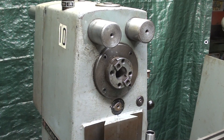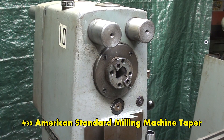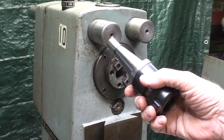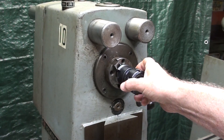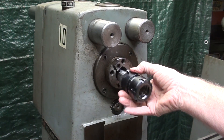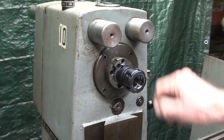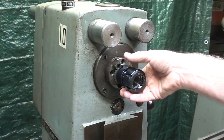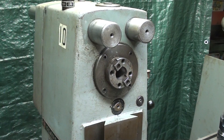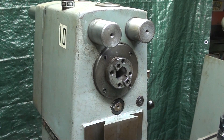Some of this is a repeat that has been mentioned in previous videos, but this is a number 30 American Standard Milling Machine Taper. It's a steep taper. It is not a self-holding taper as are Morse tapers and many other tapers. So in other words, if you don't have a drawbar to hold this in, it isn't going to stay in by itself. It has to be held in place, pulled into the taper by a drawbar — and this is the drawbar. There's a spindle hole that goes all the way through in a 21/32 diameter, so relatively small. They also make larger machines that are number 40 and number 50.